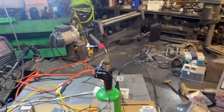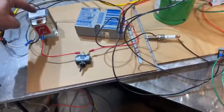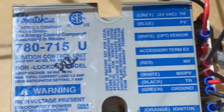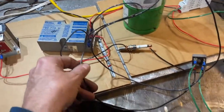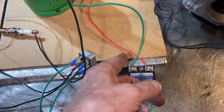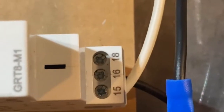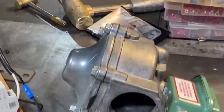We are controlling some flame here. It took all this to do that. The solid state relay is simply running the S trigger. We have 24 volts running into this module, and any of these modules will work if you want to replicate this. We are rectifying the 24-volt signal into DC, which is then powering a solid state relay, which is connecting 120-volt AC current to A1. Contacts 15 and 16 are connected in the normally closed configuration — so flame on, you get gas; flame off, no gas.